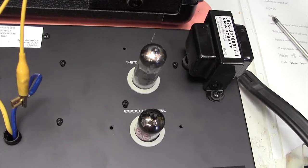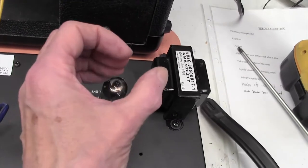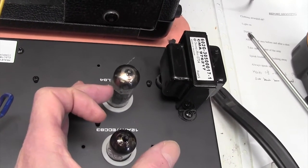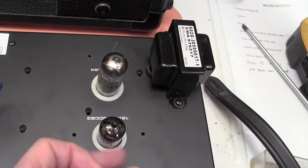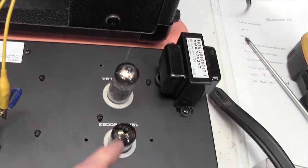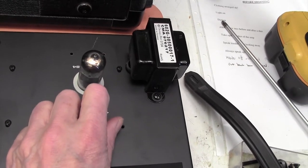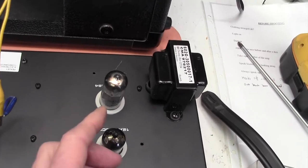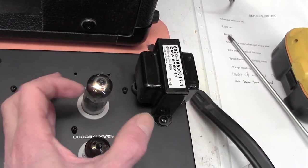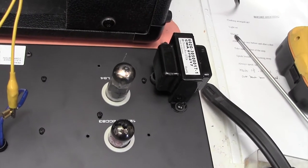One thing you can do — it's unusual to have to take the chassis out here to actually see the valves — is get yourself a tea towel and wrap it tightly around the valve, hold it as tightly as you can, and then strum the guitar. That dampens down any acoustic waves hitting the valve. You can do it with the preamp valves as well, so you can just go along the valves holding each one with a tea towel to find the microphonic valve. It's usually a preamp valve, not a power valve. That's a nice little trick. Then you can just find the valve that's vibrating, take it out, and put a new one in.